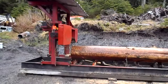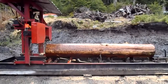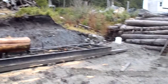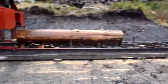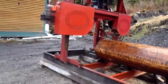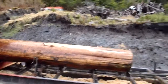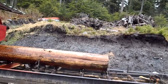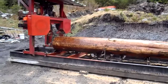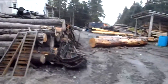I've got the carriage rocked ahead just a little bit now. I just finished setting it up — I moved the mill and built the planks it's sitting on, six-by-tens with ties underneath. We went out last year and got rock and sand to tamp it up and bed it in. I lag-bolted the mill down using holes that were already drilled in there from previous adjustments. It's level and straight now, but we still have to put the lumber clamps on.